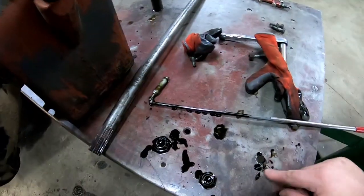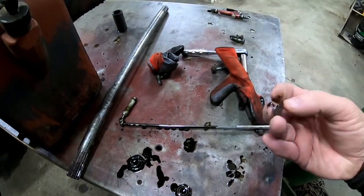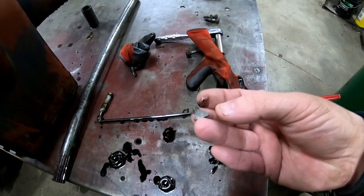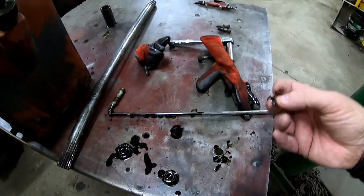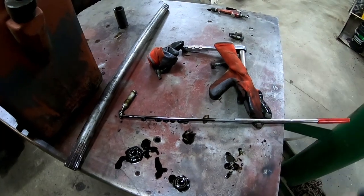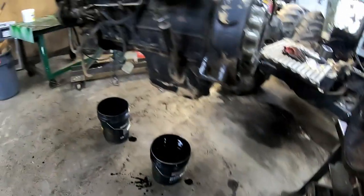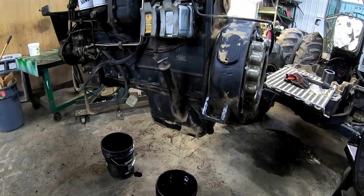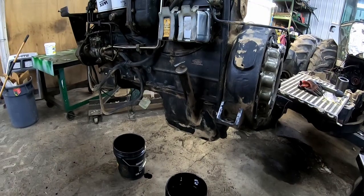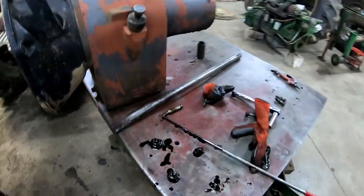Yeah, I started draining the engine oil and I heard things go tink, tink, tink into the oil pan. I would say the magnet picked that up from the cross hatches on it. I would say that's a piece of sleeve. My guess now is that whether it's related to that ceramic or not, I suppose it's possible, but I'd say a sleeve broke at the top and dropped down, and then the rod hit it and shattered the lower part of the sleeve.